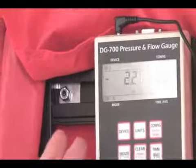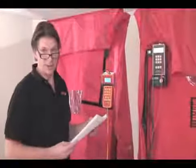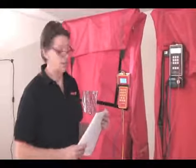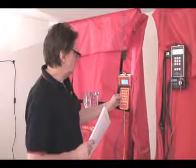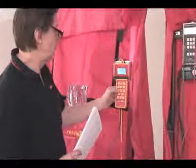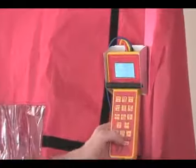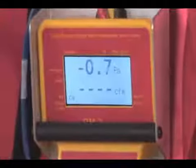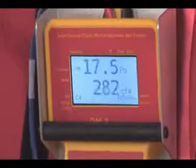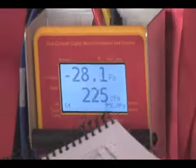That's how it's done on this gauge. This other gauge can suffer the same problem if we have the 'at pressure' setting on there, but it does have a different mode you might find really handy. We can go set pressure 15, enter. And by pressing the 'at pressure' mode, we can have it extrapolate to 15 pascals, which is actually our set point.